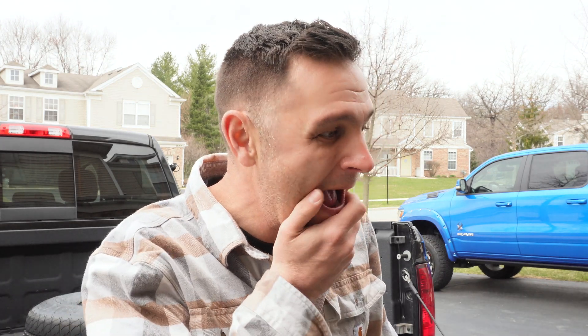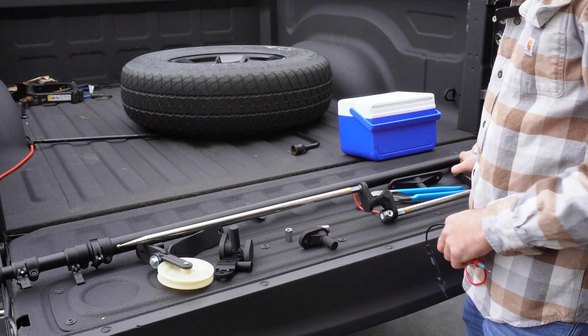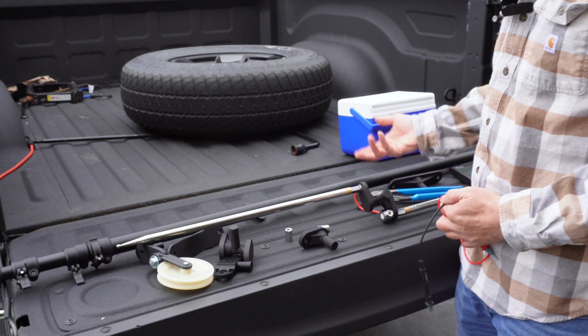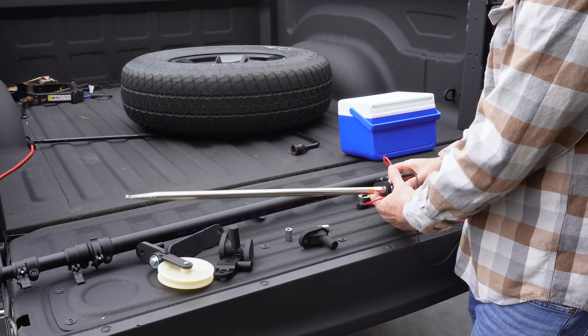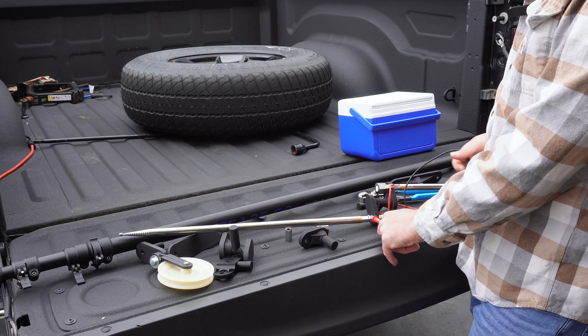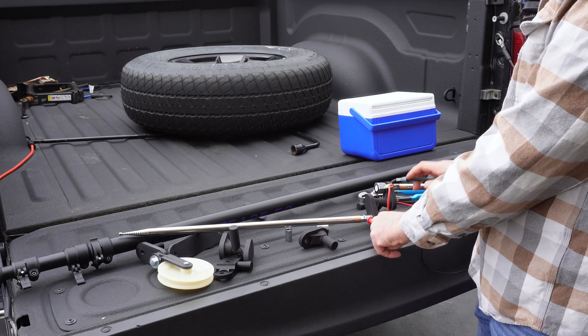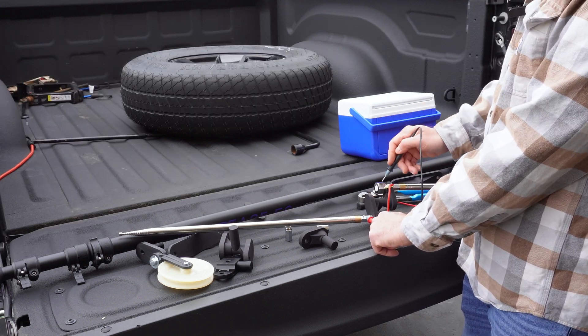Let's start off with 20-meter telescoping antennas on both sides and see how this does — see if we can make contact, see if we run into any issues, and discuss them in just a few moments. Now, there are a few things we want to check here. Because of this wire, that is a potential failure point or another variable we have to consider. I just want to make sure that this section of the dipole isn't giving continuity to this section of the dipole, because that shouldn't happen. And it's not.